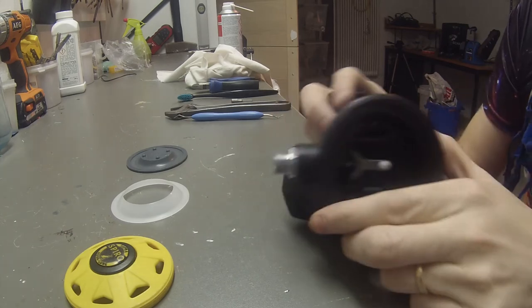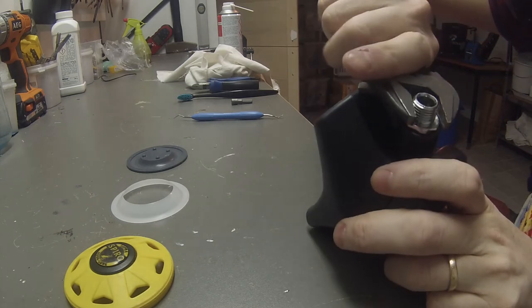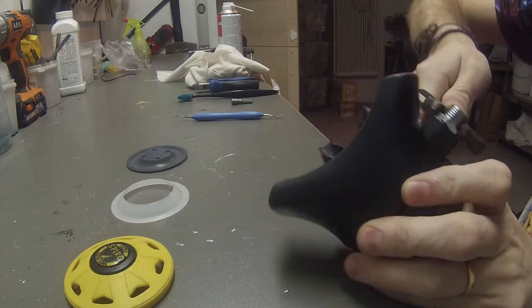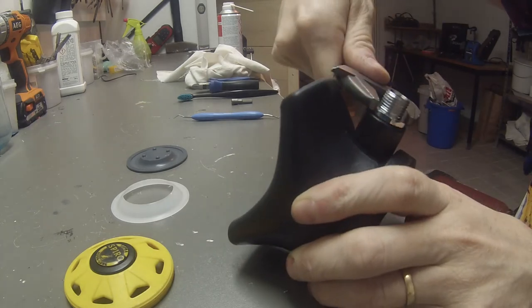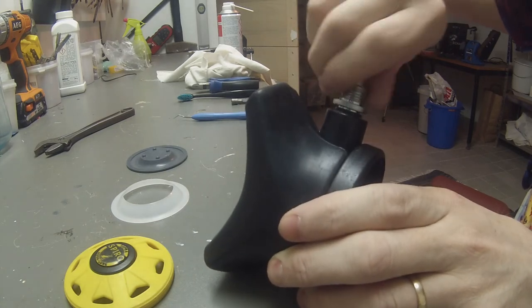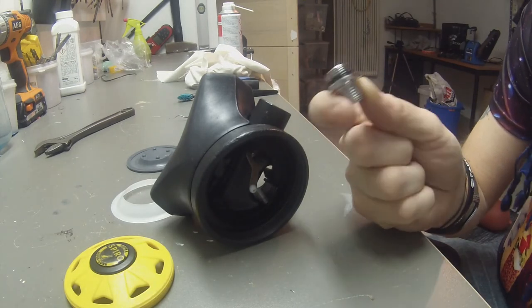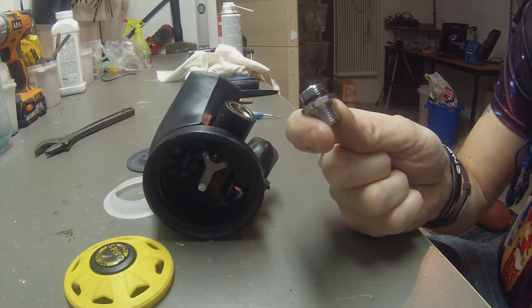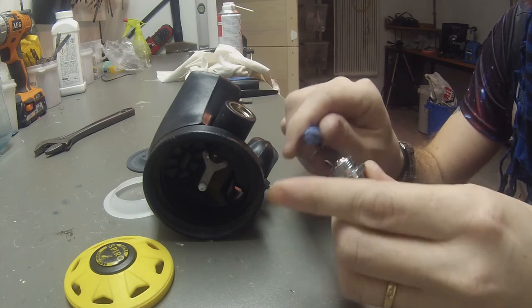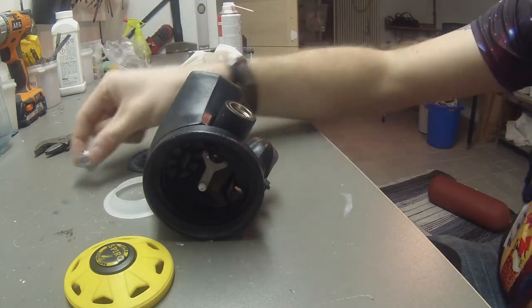What we're gonna do next is remove this screw. So we take a standard wrench and carefully remove this. Here we find the only o-ring inside this regulator. We will remove the o-ring with the dentist tool. Always get a new o-ring, so we'll discard that one, and put this aside.